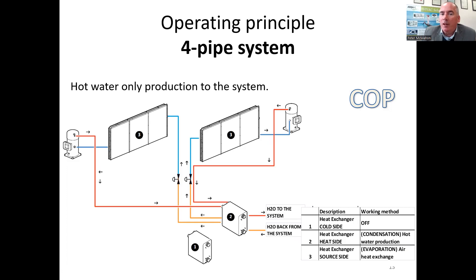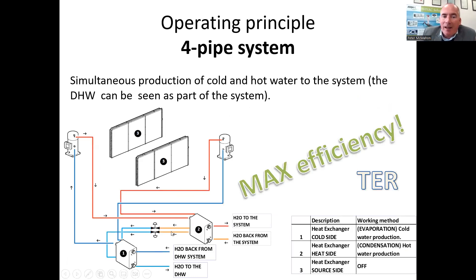That is heating mode, and it works even when there's no cooling. That's the key difference between the multi-functional heat pump and the chiller with a recuperator — you cannot do this mode with a chiller recuperator. With the multi-functional heat pump you can also have simultaneous cooling and heating: the external heat exchanger is completely out of the loop, refrigerant is pumped through the recuperator heating the water, then through the expansion valve reducing pressure and temperature to cool the water, and back to the compressors. In this mode — called TER, or Total Efficiency Ratio — you're more than doubling your EER, your Energy Efficiency Ratio.